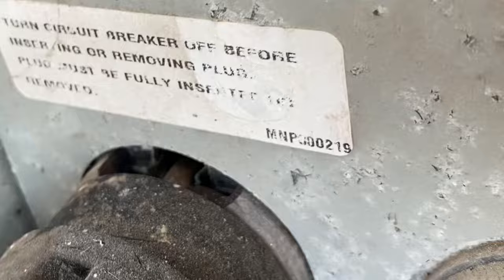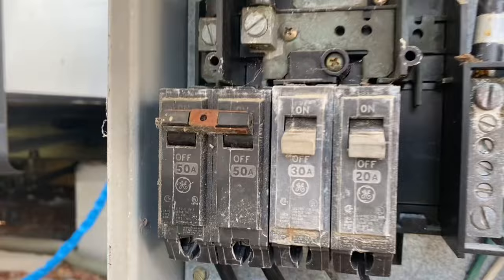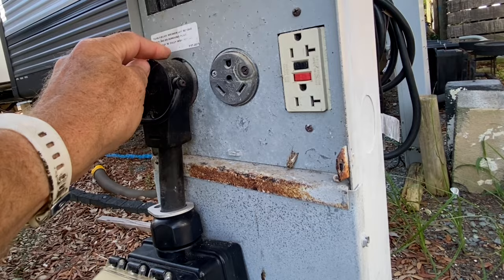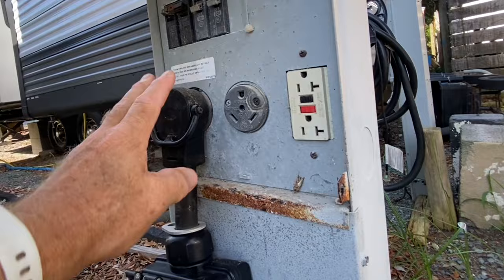This is degraded — the ground part of this is broken. I'm going to take the two screws out, open this panel up, probably replace this breaker, and replace this receptacle, which is a 50-amp. Pushing it in got it running again, but then I continued to have outages after a few hours. That's when I noticed the damage to the receptacle. I pulled it out to see if it was charred from arcing — it was also not fully plugged in. I pushed it in and out a few times to clear anything and it worked overnight. We had air conditioning overnight.